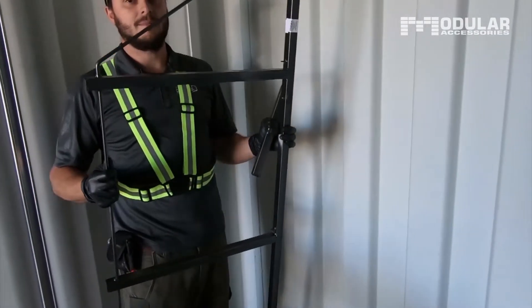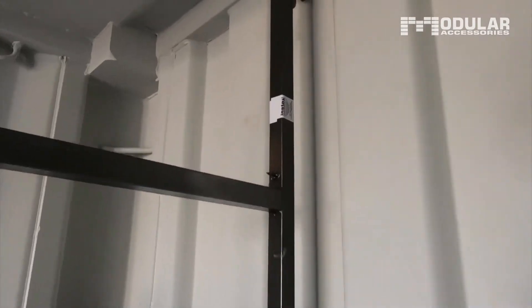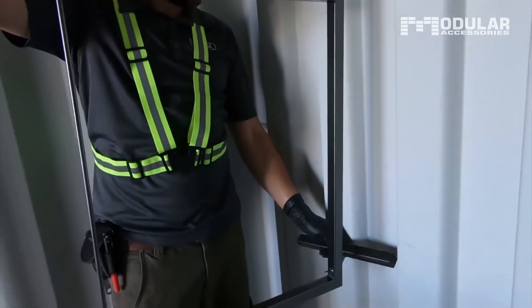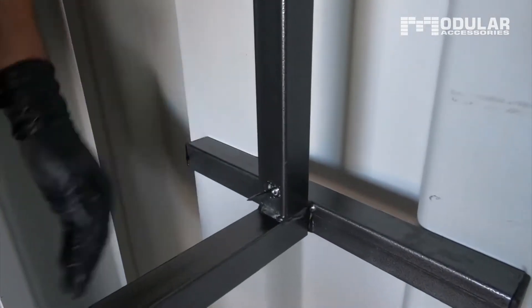The final step is just to hang your shelving brackets in place. Don't forget you need to put your T-bar in the back end of the shelving bracket — that's what keeps the whole shelving plumb.